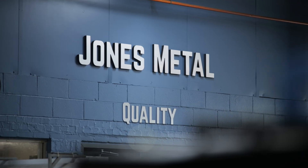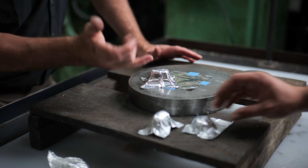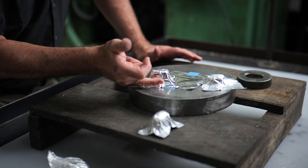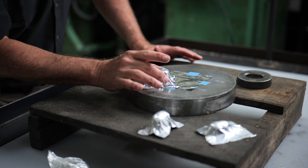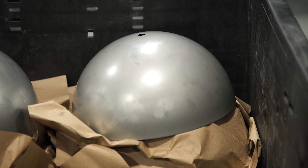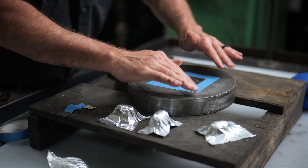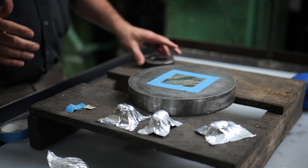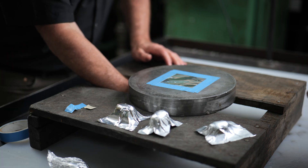Now we're trying to create a more perfect part. We have these formed parts, but they're not formed clear down in — they do have wrinkles or places where they gather. So we're trying to get deeper on an engineering level. We're going to restrict the flow of the blank now from all four sides. Sam's going to hold the balloon with two hands to get maximum pressure, and I'm going to drive the punch up into the part.